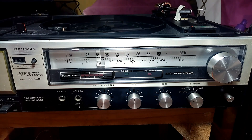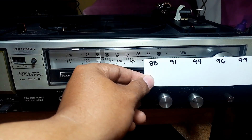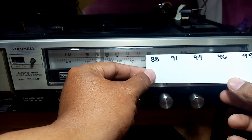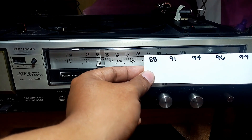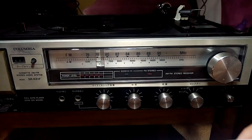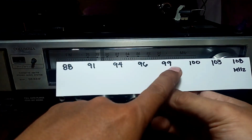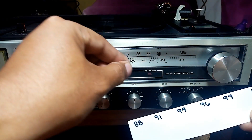First thing — make sure you have an electronics background to do this work. I have a guide here: our channel starts at 88 until 108 megahertz, so the channels I can pick up are from 88 until 90 or 90.5. To re-channel, you need to move the band down to 76. To do that, locate the oscillator — the oscillator is the component that controls the channel range.